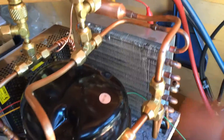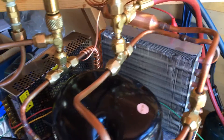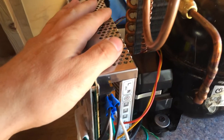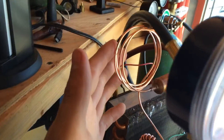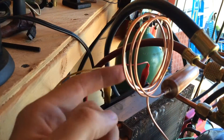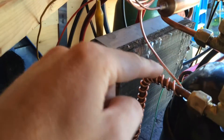It's air-cooled — there's a little 12-volt DC computer fan on the back. There's a power supply that's just for the fan; it's a little overkill for the fan, but it has the capacity to run the DC compressor, so I'm just using that. I have about 6 feet of .031 capillary tubing inside down there, running through this little strainer here, and then a heat exchanger runs down the suction line down to the evaporator.